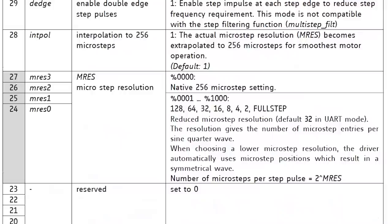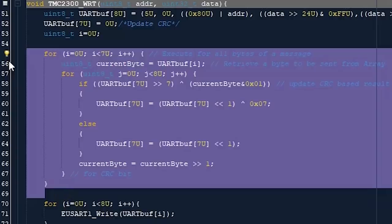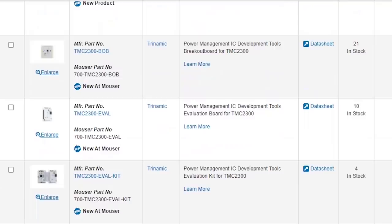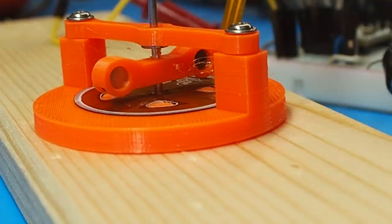This problem means the motor cannot handle the driver's minimum resolution of 1/8 microstepping. There is another option in the datasheet to change to lower resolutions like 1/4, 1/2, and full step, but this can only be changed through the driver's single-wire UART interface. I spent many hours and even days trying to establish communication with this driver, but it just wasn't responding to my commands. I'm 100% sure the CRC is being computed correctly because I verified this with the manufacturer's online calculator, and I also checked the data with my scope — it seems to be transmitting correctly on multiple PCBs. The best idea is probably to get one of their development boards and test with their software. There are still many features I'd like to test, like stall detection, but that will take more time.